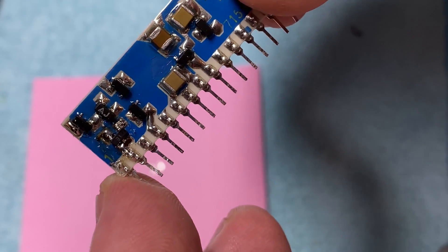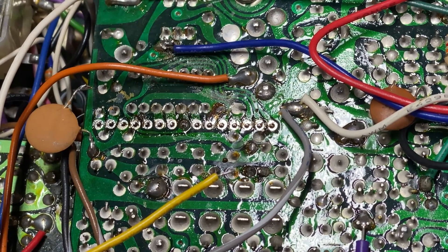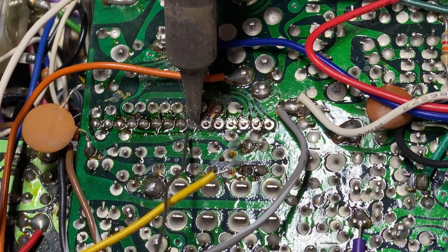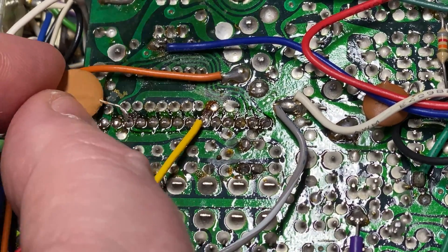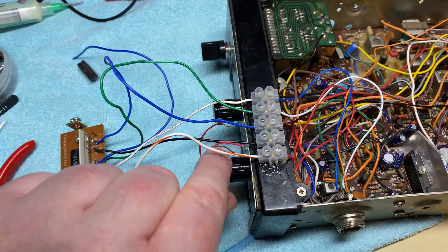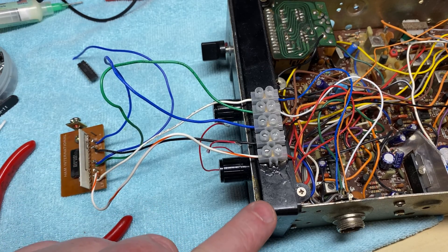Not the prettiest of jobs but it'll do. We solder it back into place, tack the centre pin so it doesn't drop out, then go over it, put the wire back, put the capacitor back — and it wasn't working. So I took the thick film back out again, put it in a test board, and tried it in my test radio — and you can hear the thick film works perfectly, so there's nothing wrong with the repair.